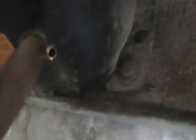I've already cut out this little factory stub and I'm going to debur it right now. I'm going to use nitrogen in the system because as I ream it out, I don't want the shavings or debris to get down inside the system. The nitrogen will be acting against that, pushing against the shavings that will be deburred from this pipe.